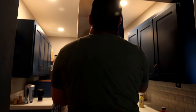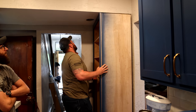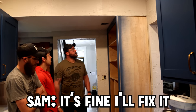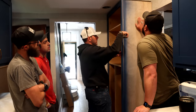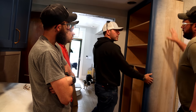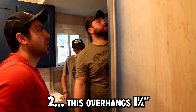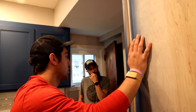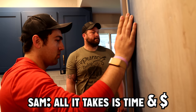The pantry's here! It really didn't look like it was going to fit. We need to scribe that in but the width's a bit off — you can only make that 3 inches because you're going to cut it back. This overhangs an inch and a quarter, so if we come an inch over here, this is 3 inches wide, so it's going to be tight. We have pull-out drawers here so we need it to be wider. Everything's fixable — it's all wood. We'll get it in, take a measurement, build a panel, and finish this. We're going to have to put a spacer block in here to screw the front of it in.